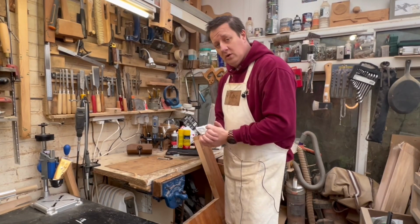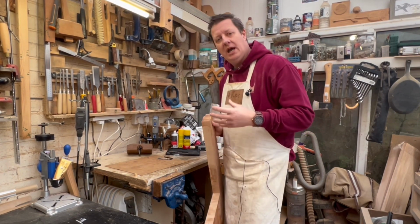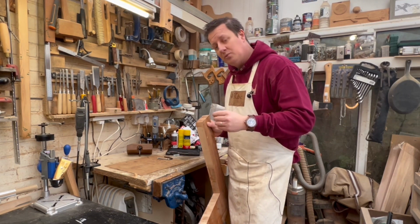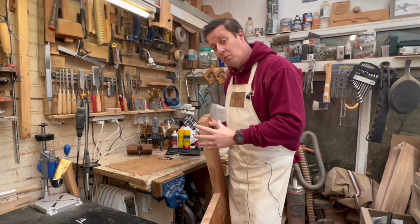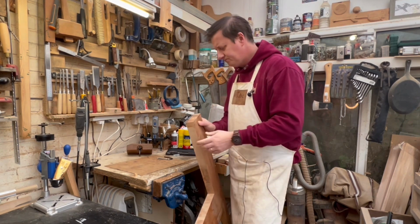But before we go grinding off any Allen keys, we need to find a chunk of wood that we're going to use. Now you're better off with a hardwood rather than using pine. As much as pine will still work, it won't last as long, and a hardwood will actually glide over the top of whatever else you're working on a little bit better. Pine will tend to be a little bit stickier because it's softer.